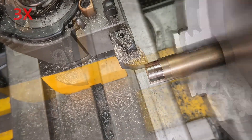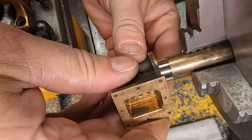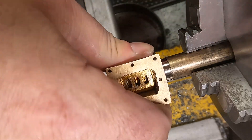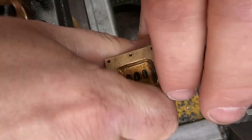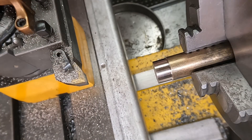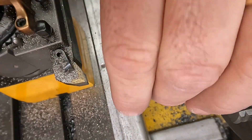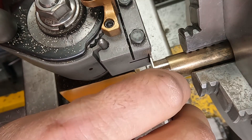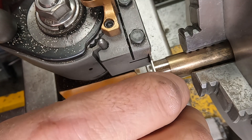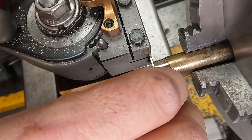Now we turn to the final outside diameter and we're a little bit tight, which is good. But when I turn the barrel around the other way we are not so tight, so I have a conical barrel — or at least it's tight at one end. After the escapades with that barrel earlier it's not surprising, so I'm going to leave it at that and work those issues by hand.